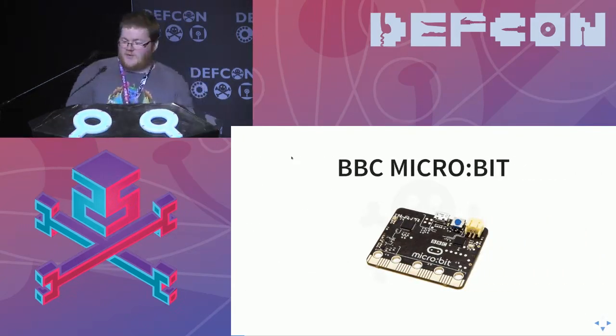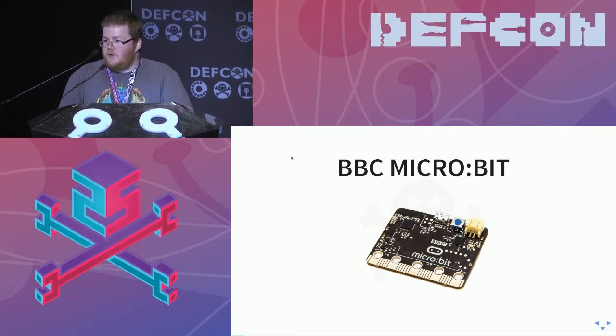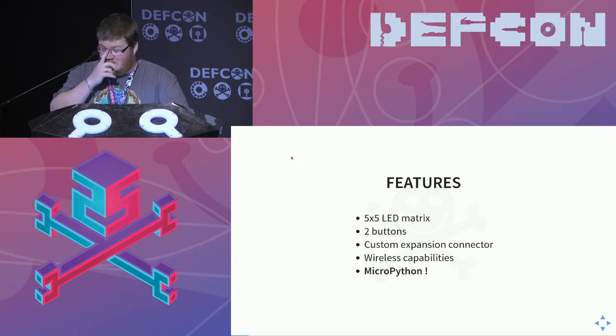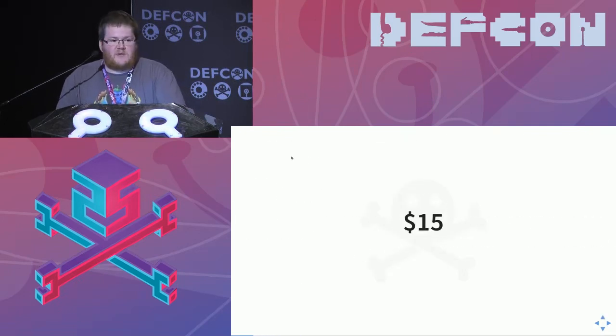So first of all, the BBC micro:bit. This is a BBC-sponsored device that was given to a lot of students in the United Kingdom in order to facilitate the learning of coding in UK schools. Basically, it has a 5x5 LED matrix, 2 buttons, a nice custom expansion connector, and also wireless capabilities. This is worth noting because it is the interesting part of the micro:bit. It's running MicroPython, so if you want to code in Python on the micro:bit, this is possible. It costs only $15. I checked on SparkFun, so if you want to buy one, it's very cheap.